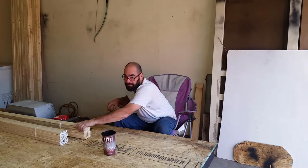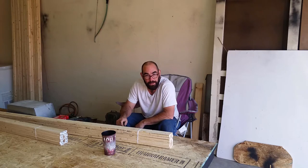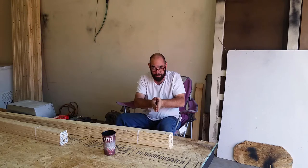Okay, here's what we're going to do this video — it will tie into the rest of them. We're going to make wall components. We're going to take these 1x2s. They're just an inch and a half wide, three-quarters inch thick — basically just furring strips. Now I could have used a 2x2, but once a 2x2 is already twisted, it's hard to take that twist out. But using two 1x2s, you can actually straighten one whenever you nail the other one to it. So you're just sistering them together to make one 2x2.